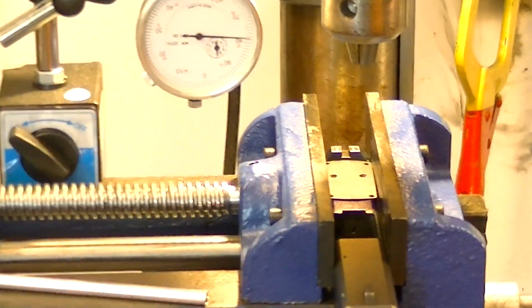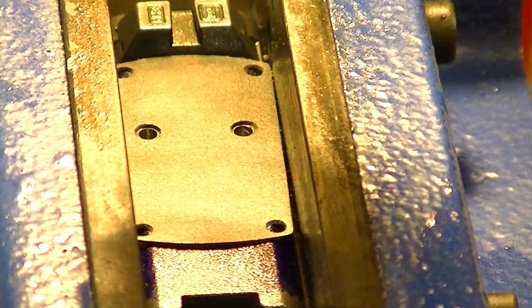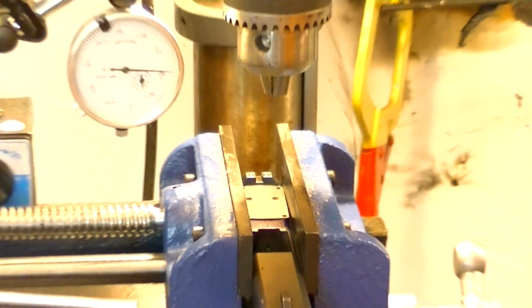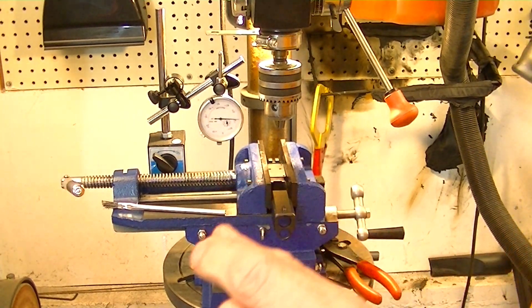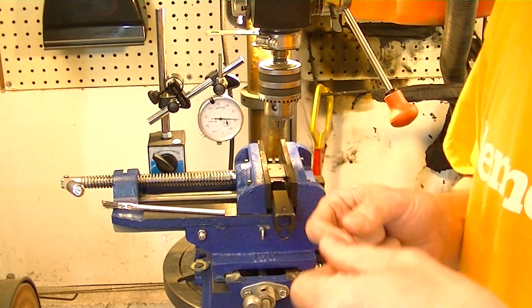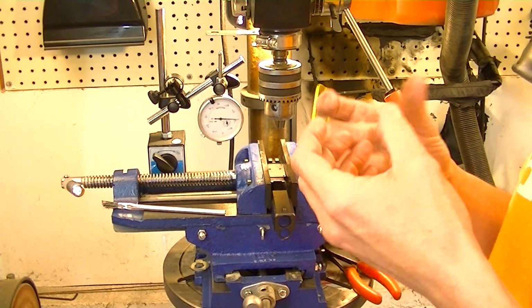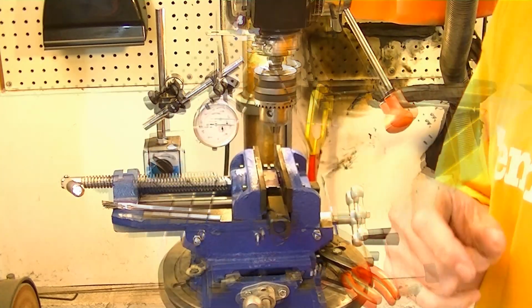Again, I know it'll probably be hard for you all to see. Maybe the angle makes it look like they're off a little, but they are dead nuts on. Very, very happy with the way those turned out. You know, there's workarounds if you get them just a little off center. You typically go with just a little bit smaller piece of hardware than what, say, the holes in the red dot will accept. That way you can have a little bit of play, but you don't want to get so small that the sight isn't going to be rigid and strong in there.